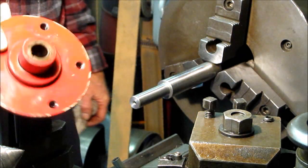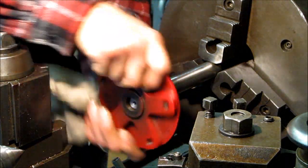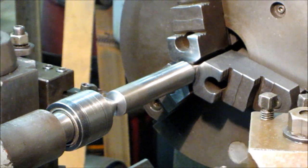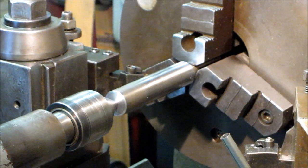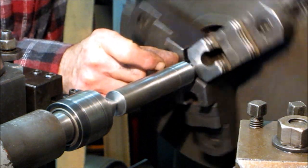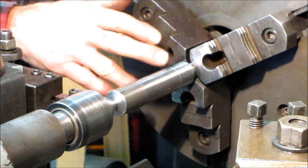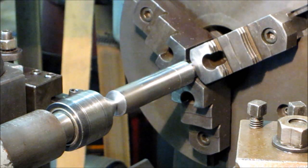That three-quarter bore is actually a good test fit — the other bushing just has a little wear, so this is a good gauge. That right there is about the diameter of the boss, so we'll even that housing — the flange that bolts the bearing to the transmission — and that will take up the slop in there and be a retainer for this axle. That's where our starting point is anyway.